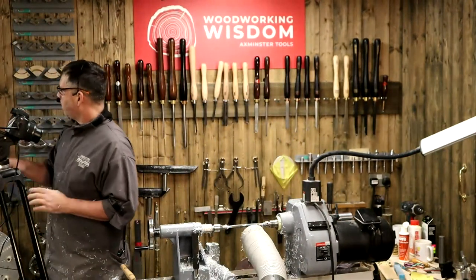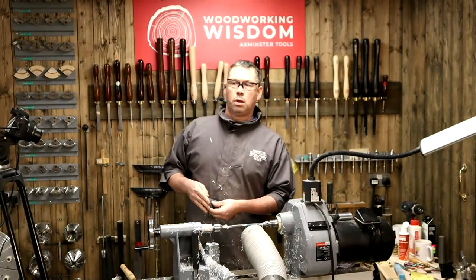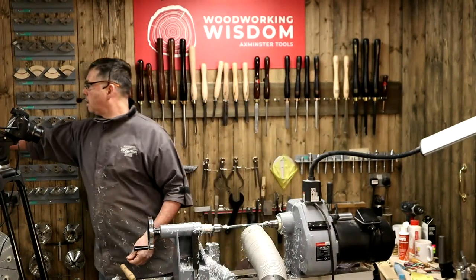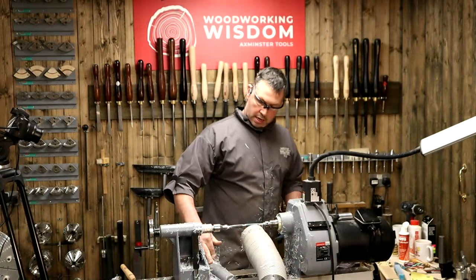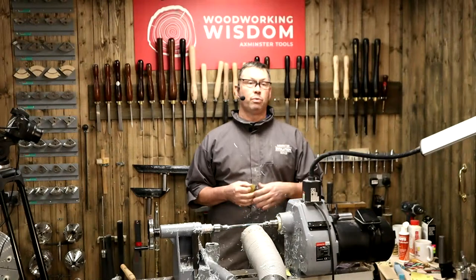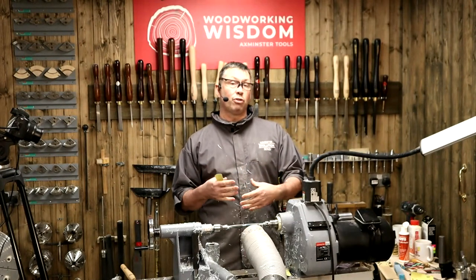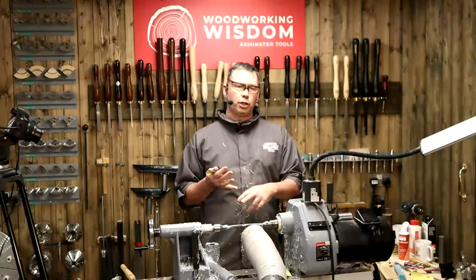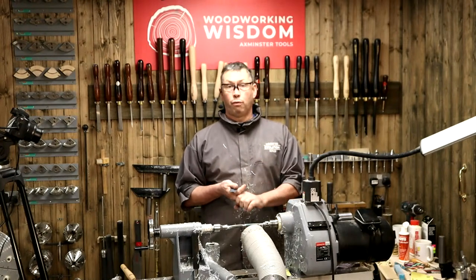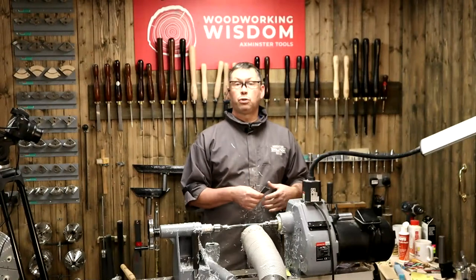And on another topic, where can you get hold of 100 mil by 100 mil or 4-inch by 4-inch timber for jam chucks? Something like tulip. Yeah. And I think they've sent in an email. Yeah, so any timber yard, if you go to, we have one called Devon Hardwoods here that we use, and that's kiln dry timber. If you go to commercial timber yards, then you probably find air dry timber. But you don't have to use tulip. You can use anything as long as it's not prone to splitting. Ash is no good. Chestnut's no good. Softwoods are no good. Everything else is fair game. So maples, sycamores, limes, elms, oaks, all that sort of stuff.